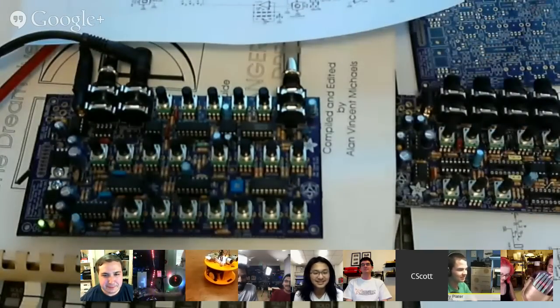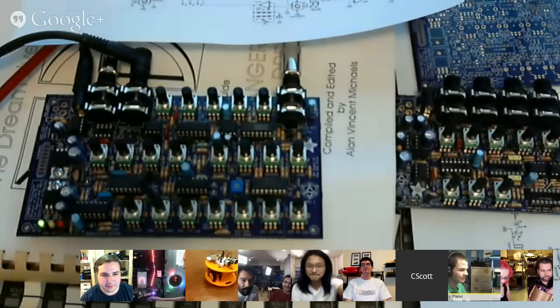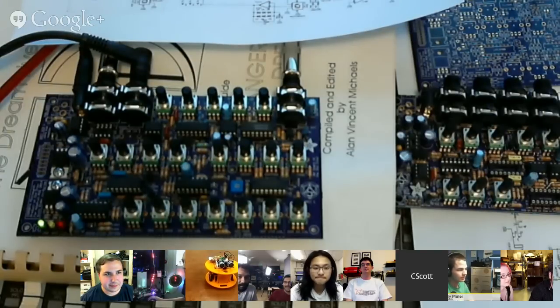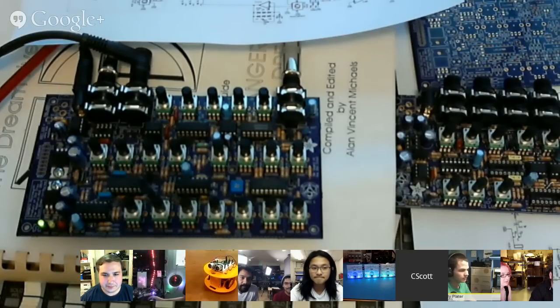Well, I've been working on microsynthesizers. I call this one a nanosynth. It's a full synthesizer voice done in a configuration that doesn't reuse voltage-controlled parameters, so you can cut down on the number of components quite a bit. One VCO, 2-pole filter, a 4-stage envelope, and a whole bank of modulation controls, because modulation is where the fun is. But just some basic operation here.